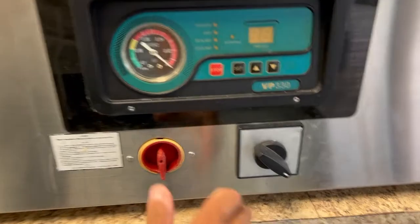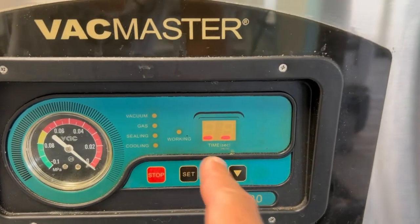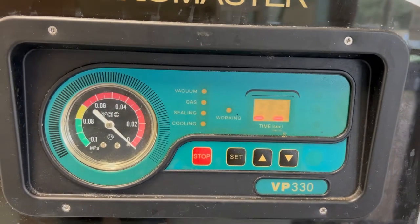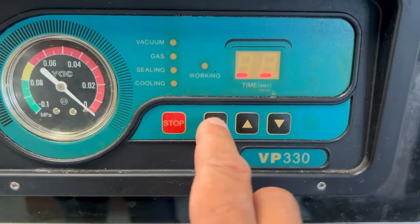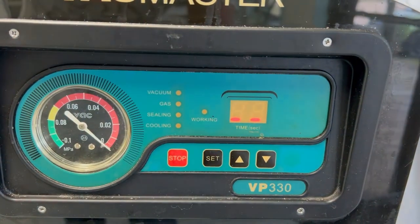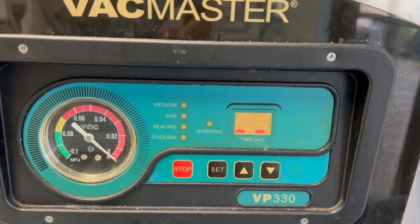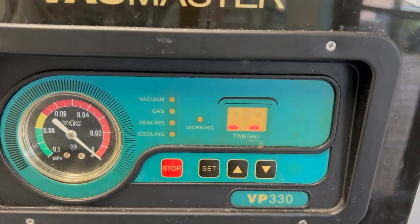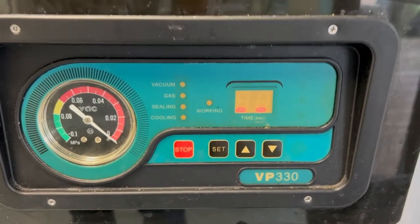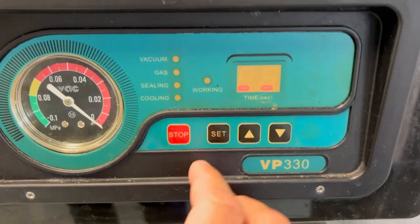So to turn this thing on, you take the switch and you flip it clockwise. This will come on. Those two little bars under there means that everything is cool. Now, I've never messed with the factory defaults on this thing. So you can press this set button so you can set the amount of vacuum time. You can't mess with the gas. I don't even know what that means. You can set the amount of time it takes to seal, which gives you a harder or lighter seal. And then the cooling part, which I also don't really know what that is, and I haven't really messed with it. So again, I'm a poultry farmer dealing with very perishable type stuff. Didn't really have to mess with the defaults. But in case you ever do,